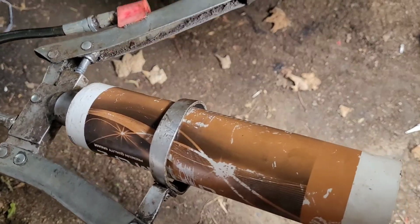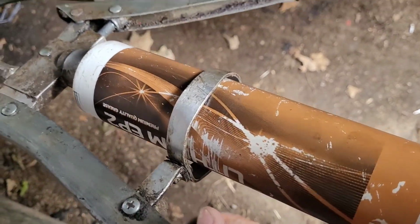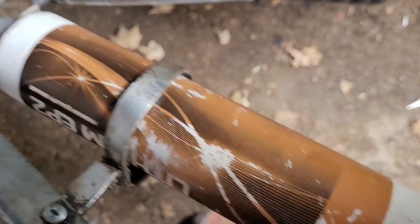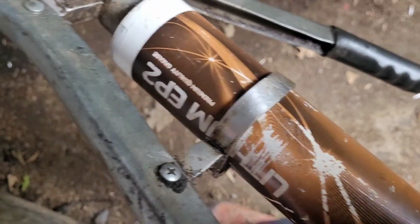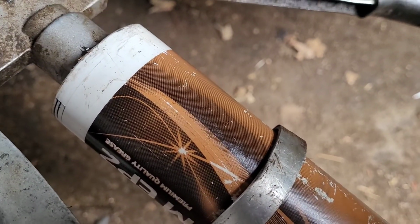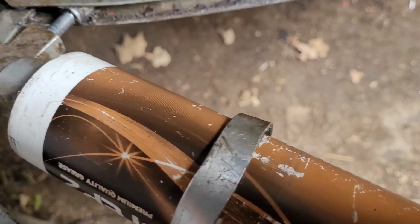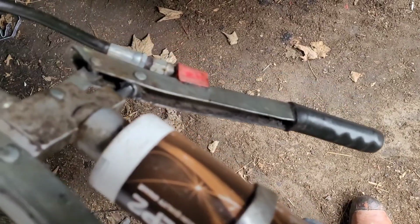Only thing to watch out for: different makes could have different threads on the top. So I think this takes the Fuchs cartridges. I got these box cartridges with it, a Bepco brand one. But I have the blue grease, and I think that's Fuchs, and it fits in this. The blue one isn't quite the same thread, but if you don't tighten it, you only put it in just a bit, and the thread's holding, and it's the right one. But it's something to watch out for if you can't get the cartridges or you're stuck with the same brand.